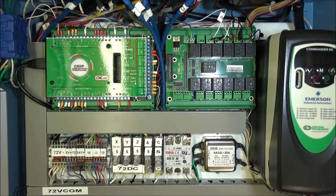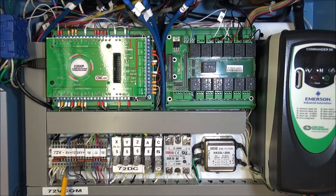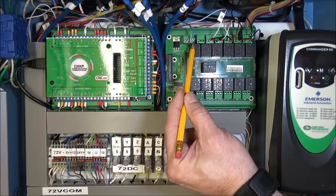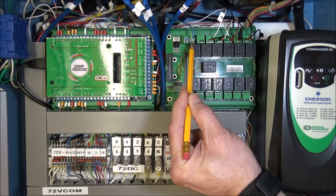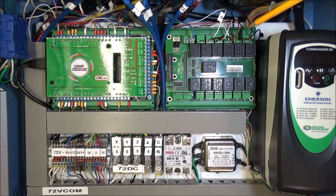The M26 board won't work unless we provide power to it. We brought power in from our 5 volt TriPower power supply separately to the M26, with the TriPower common going back to the TriPower ground. The M26 also needs to be enabled, so I added a jumper wire: 5 volts comes out of the board and we sent it right back to the enable pin, which keeps it enabled as long as there is power.